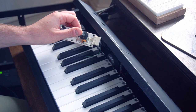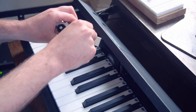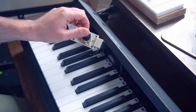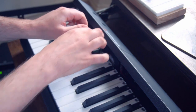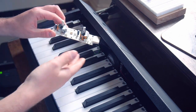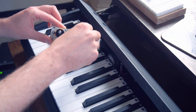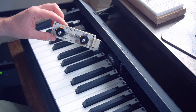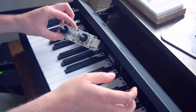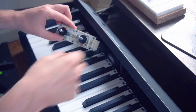So this is great, except for the fact that this potentiometer, or this joystick, is spring-loaded in the y-axis. So if you want to play with it all the way open, you can only play one-handed and you have to sit here and hold the joystick up. It's very limiting in a sense, and, I don't know, am I crazy? Is this just a backwards way to do it? It seems like maybe they came up with this interface and then did the software afterward and tried to fit in what they could. Anyway, what I think we're going to do is put in a knob and have a switch to toggle back and forth between the joystick and the potentiometer underneath the knob.